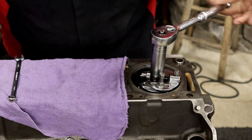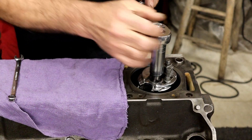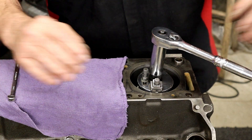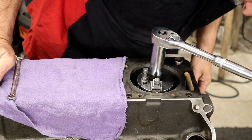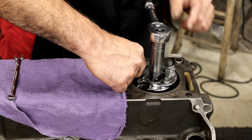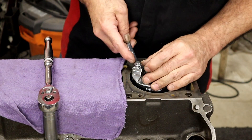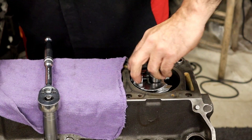I want to see the blade just come up above the deck. If I keep going out, the blade is just going to come out and start cutting the bore out on the top — and you don't need to cut that bore out on the top. Beautiful — that's it. Bring the cutter in, screw it back down.